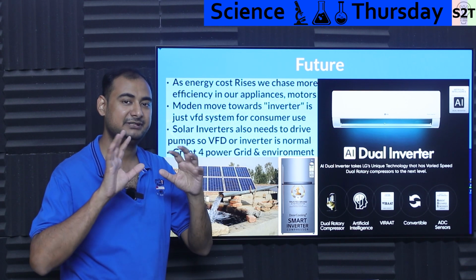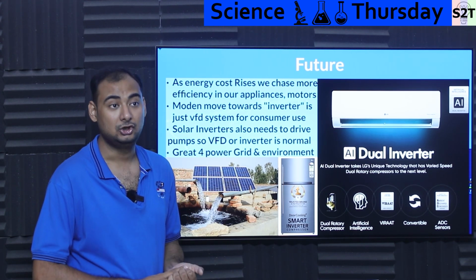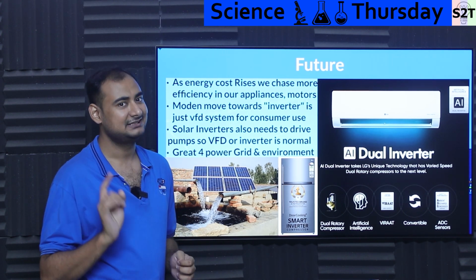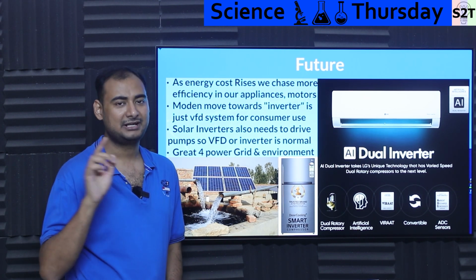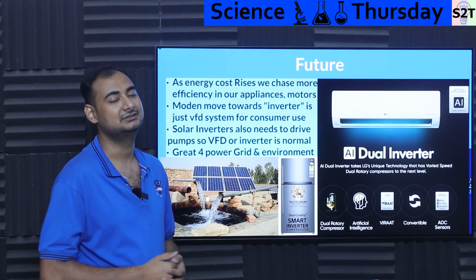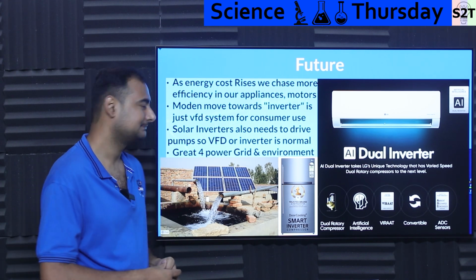You have an induction motor that can be tamed properly. Benefit: no surge. Another benefit: good power factor. You want a power factor of 1, which generally is not achievable, but if you have like 0.99, ultra good. If you have 0.95, more than good enough. But if you are running a raw, naked induction motor, that could be as low as 0.8, or even worse in some scenarios.